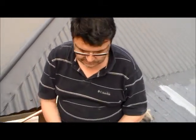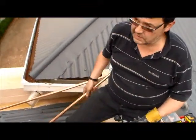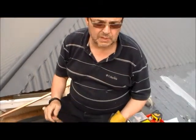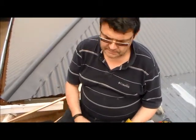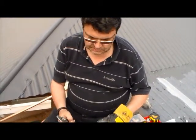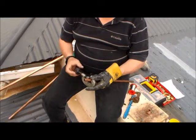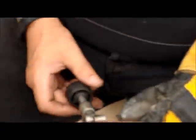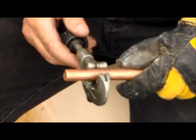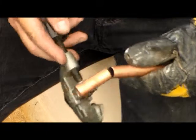We're going to do a quick lesson in soldering copper. This is a pipe cutter. I'm using two types of pipe - a half-inch pipe, and one of the connectors on the geyser installation is a three-quarter inch pipe. The pipe cutter is very easy: you put your pipe in the position where you want to cut it, tighten the screw lightly - there's a blade - then turn it, tighten, turn it, tighten, until it is neatly cut off.